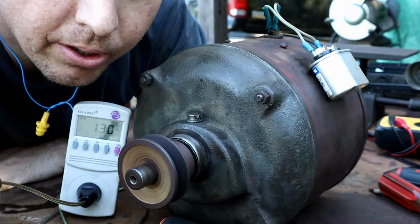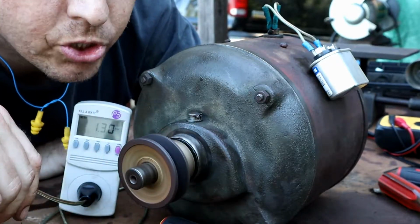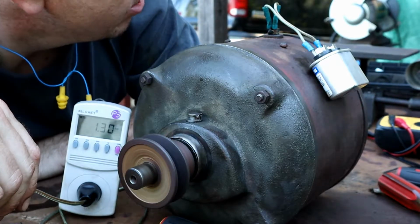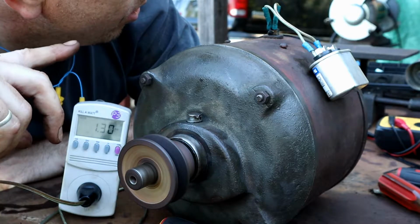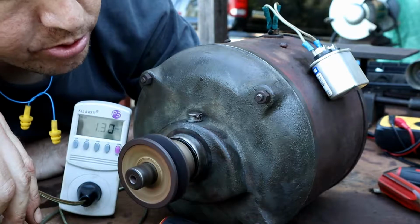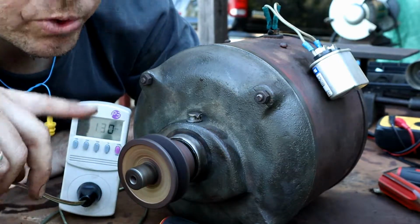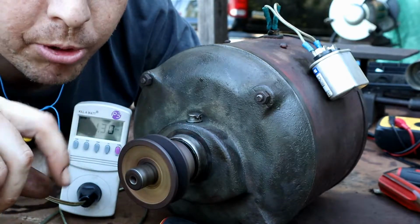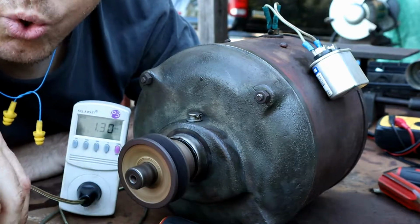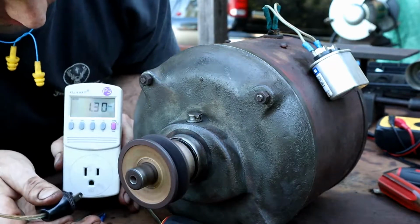A little bit of hard work, a little bit of grease under the fingernails, and we have a fully functioning motor. It's going to work perfect for our little belt sander, and I'm just going to wire it up for 230 and run it as it's wired here. I can plug 230 directly into our line connections on that terminal block. That'll boost our amperage up, that'll boost our starting torque up, and it is going to be phenomenal.